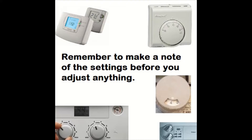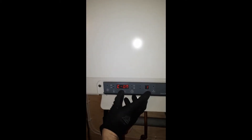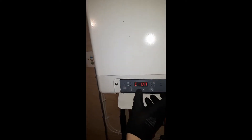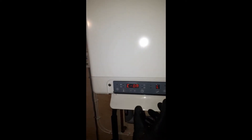To get this boiler into service mode, there's the display on the front. Push the spanner button and the minus button together and you should get the L symbol on the right-hand side of the display, which means it's in minimum or low output.